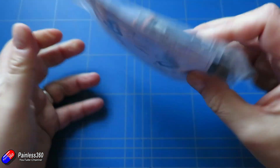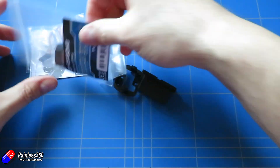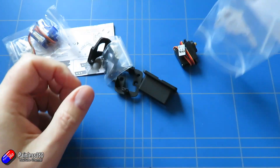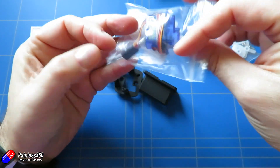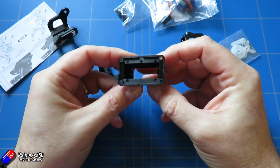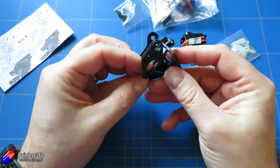If I just take all the pieces out of the bag, this is how it actually arrives. We have a couple of servos and the plastics. The bottom servo is actually metal-geared — that's the one we're going to use for the pan function — and we're going to need just one of the control horns in here. The other one for the tilt function is a cheap and cheerful plastic-geared servo, but that'll be fine because it's not supporting all the weight. We have the bottom piece that supports the metal-geared servo, the piece that holds the camera, and the cradle that goes between the two connecting everything together.